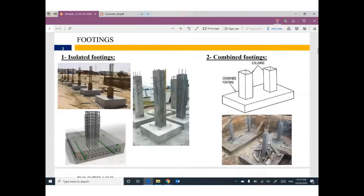The first kind of footing is called isolated footing — every column has only one footing, so this footing is supporting only one column. Each column has a separate footing. We have reinforcement at the bottom in both directions. For isolated footing, we have only one reinforcement mesh at the bottom — we don't have reinforcement at the top.